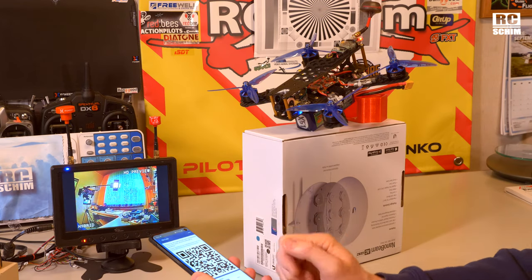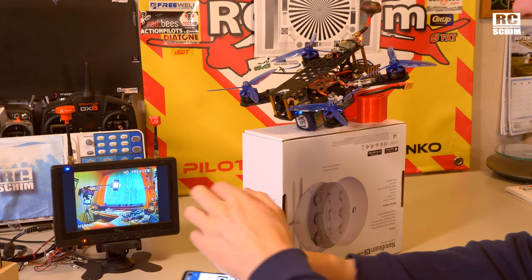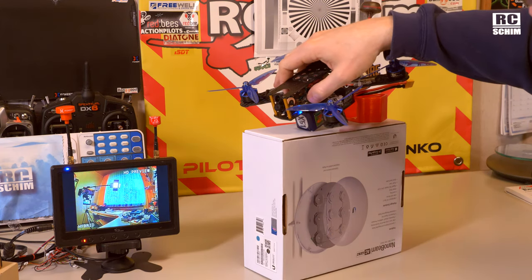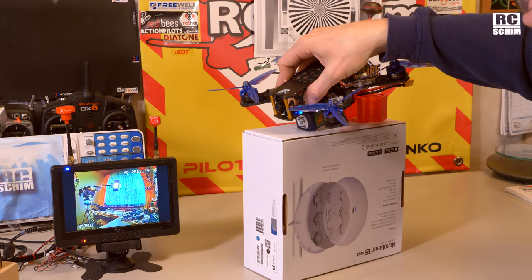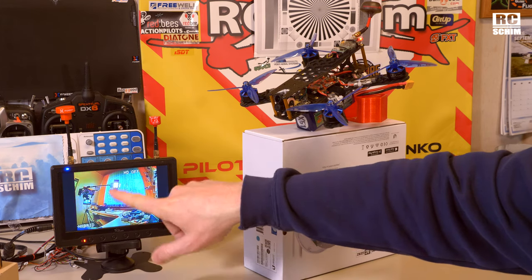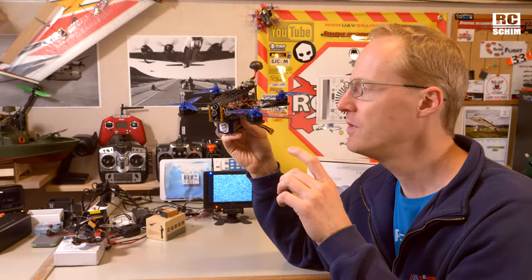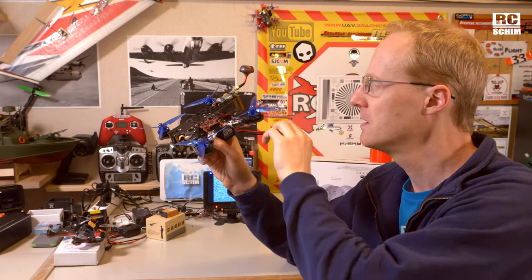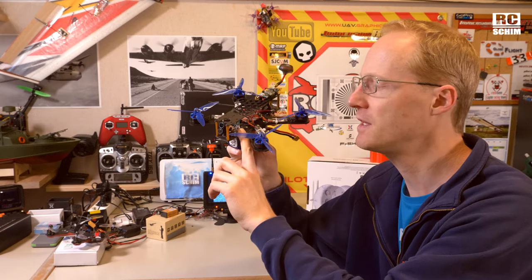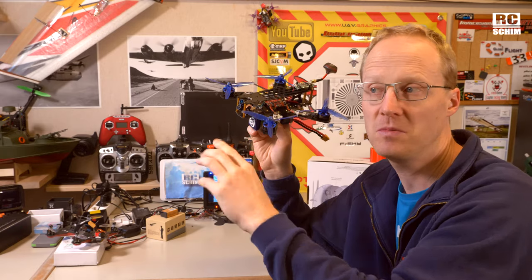It took longer than normal, but now — if it turns from green to blue, it saw your QR code, and it changes from QR mode to HD preview. Now I want to turn it off this way: long press the back button, and the image doesn't disappear because the Runcam Racer still has power and still shows you something. But you see 'HD off' — so the HD board is off. If you set it up with the QR code and then just remove the power, it sometimes loses the settings. So I think it's a good idea, once you've set something new, to power it down via the little button so it maybe stores the settings.